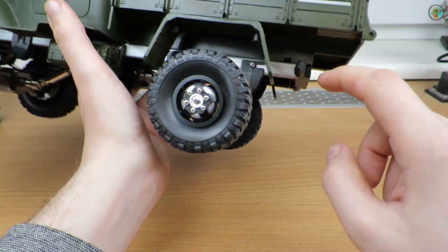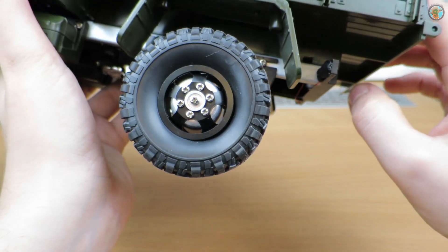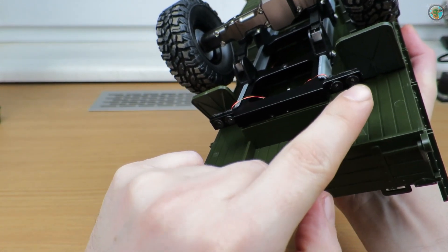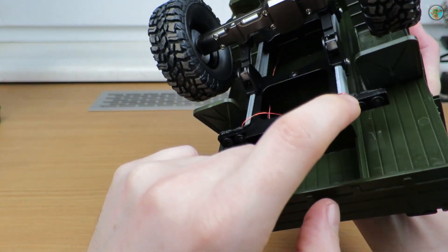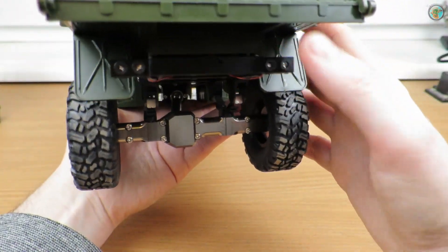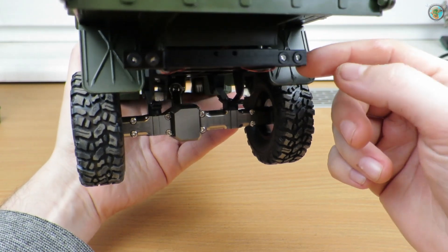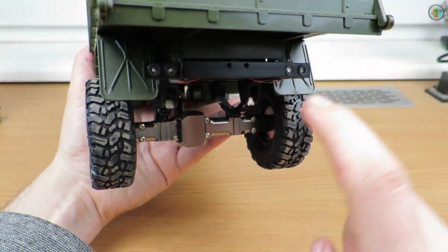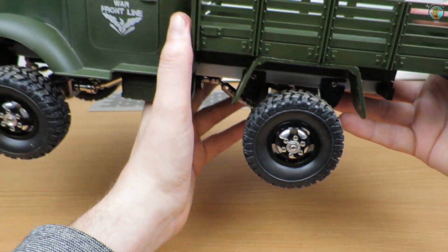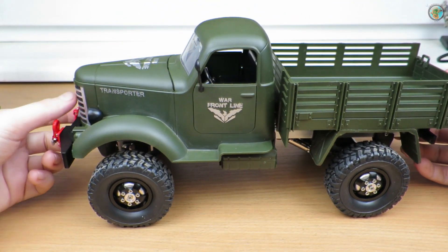For the rear lights, I used 3mm LED mounting plastic held with black silicone hot glue on the other side, because the holes are too big for M3 screws but too small for 5mm LEDs. I wanted to wire the reverse light to the motor, but that circuit didn't work, so I kept all LEDs red. I'll add a metal hook on the back once I order it.